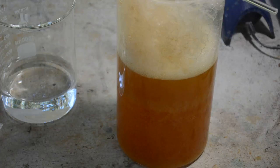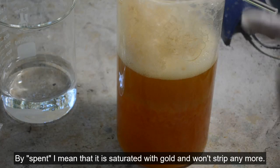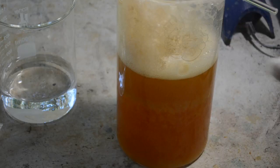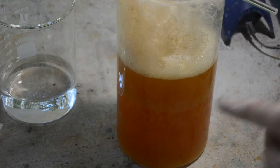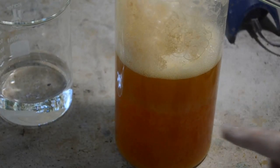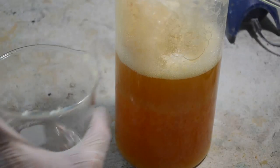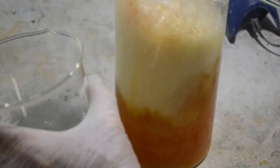Well hello scrappers. This is going to be another short video on using Eco Gold X for stripping gold plating. I've got some spent Eco Gold X here and I'm in the process of adjusting the pH down to where I can do the zinc cementation on it. I hope it's showing up on the video — the white precipitate that's forming. I'm using hydrochloric acid this time to adjust the pH.